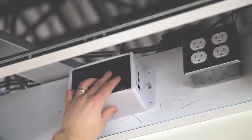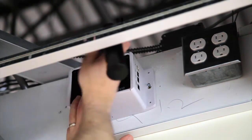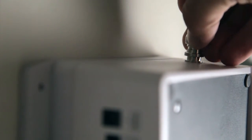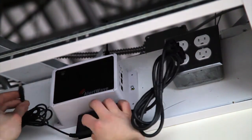Place the VNS-2210 unit on the two screws and tighten the screws into the wall to secure the unit. If the VNS-2210 is equipped with a VS-638 antenna, attach the connector to the BNC connector on top of the unit. Connect the VNS-2210 power supply to an AC outlet and plug the power jack into the unit.